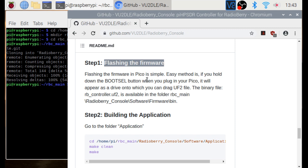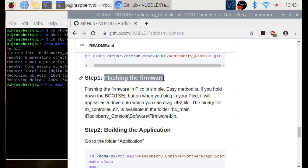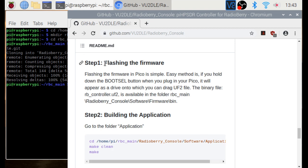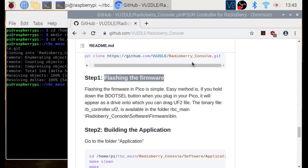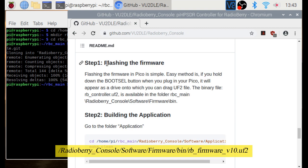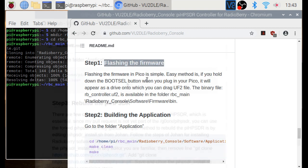The simplest way to program the Pico is to use USB mode. The Raspberry Pi website gives a very nice explanation, and you can also find several tutorial videos on YouTube. Hold the BOOTSEL button down during power-up. The Pico will then appear as a USB mass storage device. Drag and drop the UF2 file from the GitHub onto the disk — it will write the file to flash and restart the Pico. It's very simple.